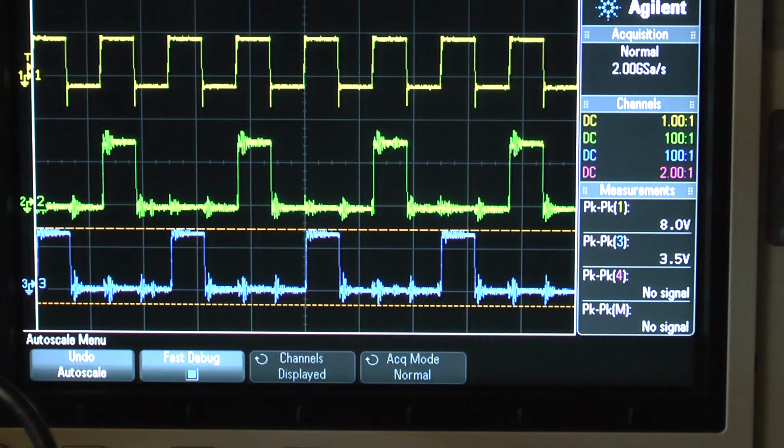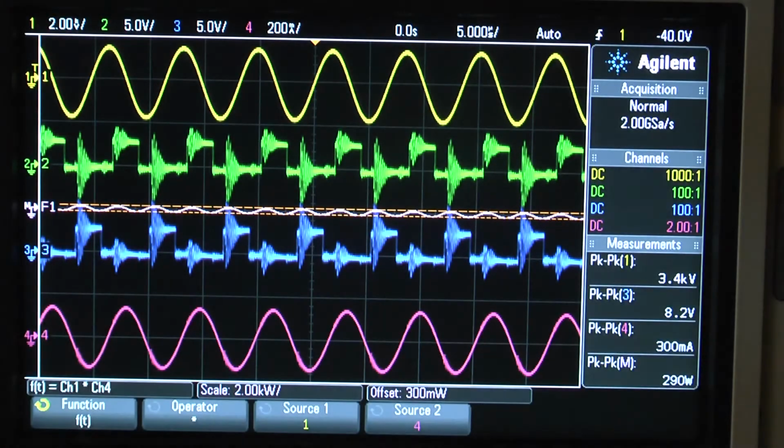Now let's move over to show you how it performs. I'm at the moment here at 295 kHz. I had 328 before, retuned the system, and it appears to be only 295, 296 kHz at the moment, not like the 328 I had before. So that's the frequency I'm using at the moment, let's say 12, 13 volt and 90 milliampere.